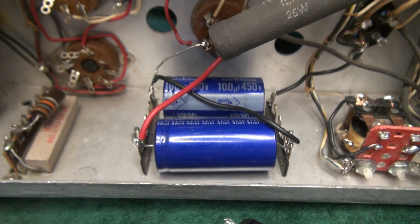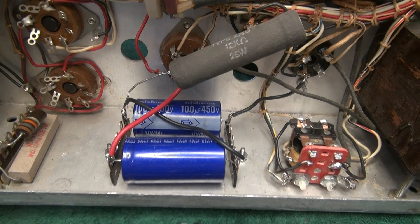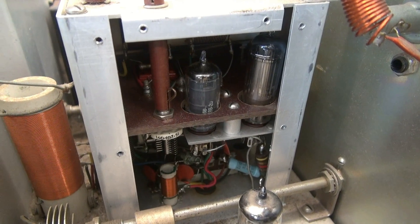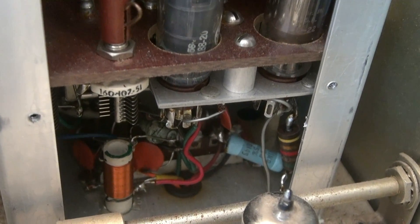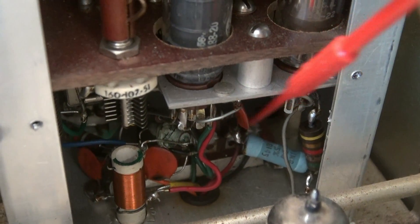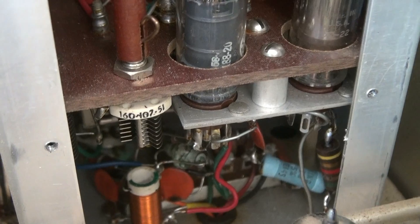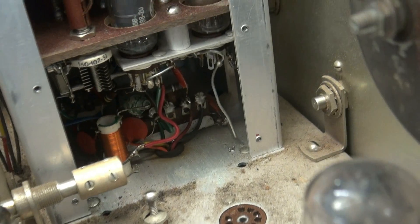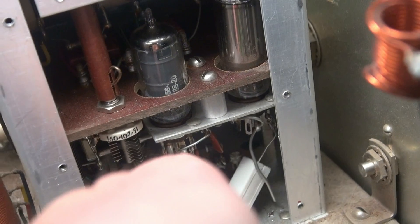Before I fire it up, I thought I better make sure Mr. Chernobyl is not at home in the VFO. He's not, but there are two resistors down here taking his place with a big glob of solder. I'm going to take that out and replace it with one nice 5-watt ceramic type. The nice thing about working on the Valiant's VFO versus the Ranger is you do have access - you have to use some long-nose pliers and tweezers, but you can fish those parts in there to reinstall them without having to pull the whole face off.